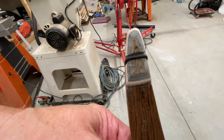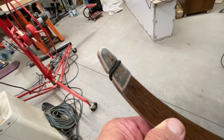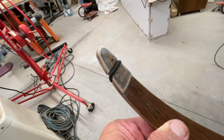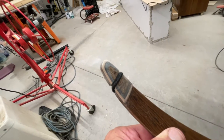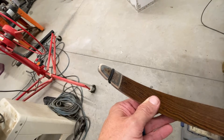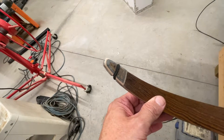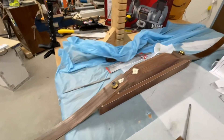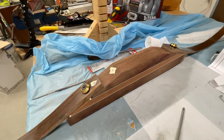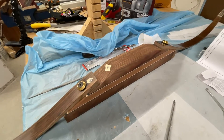All right, I think I got my limb tips finished here. That was probably the most nervous part of the whole thing - just cutting these string notches out, I think, for me. But anyway, limb tips are done. Got them on both sides, got my string grooves notched out. They're dulled from the sanding I was doing on them - of course, this whole thing is going to get dulled in the end before it gets better as we sand things down for the finishing process. But the next step is going to be the riser. I've been really looking forward to that. Stay tuned - that'll be the next video, cutting this riser out and getting it in shape.